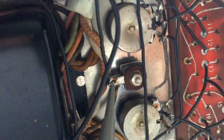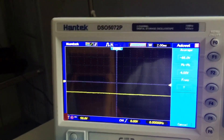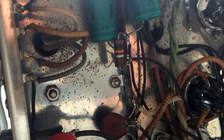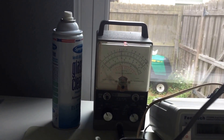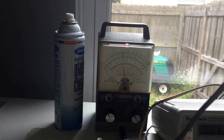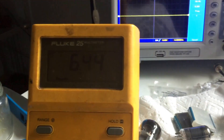With 115 volts I'm reading on the selenium rectifier minus 66 volts — I'm going to have to verify if that's correct. If I go to my DVM right there and go on the heater over here on AC, my DVM may be off ever so slightly, but we're showing 6 volts at 115, and it could be as high as 6.3. I'd like to get my digital scope on there just to verify, and on the scope I'm seeing 6.4 volts, which is a little bit high for 115.